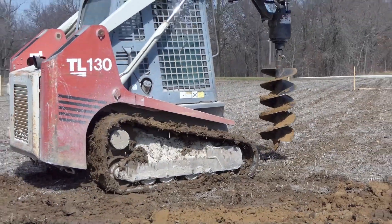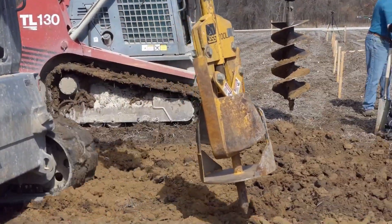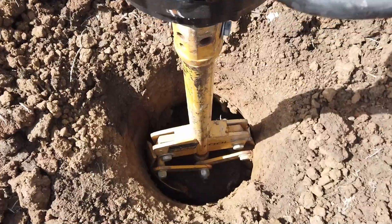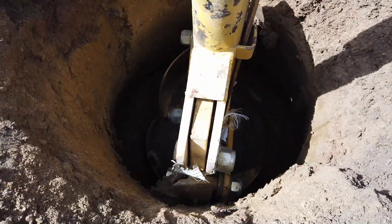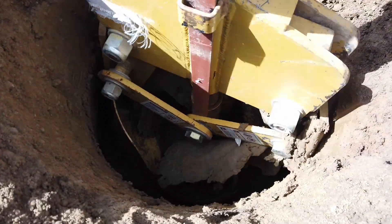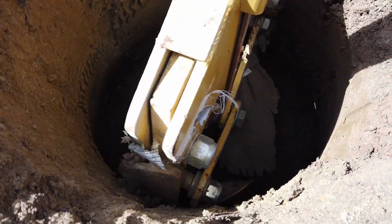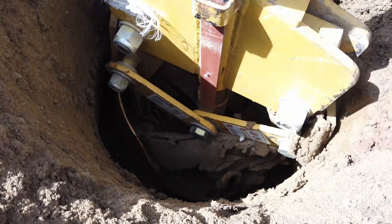After you're done with the straight auger, we use the belling auger from our sister company, Jess Tools. The belling auger works from the down pressure of the skid steer. As more down pressure is applied, the blades open wider with greater force. You will need to watch and see when the auger soil catch fills with soil and remove and empty the auger periodically.